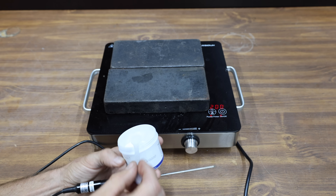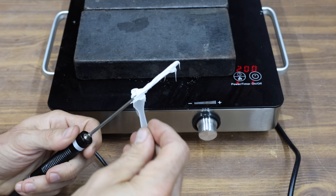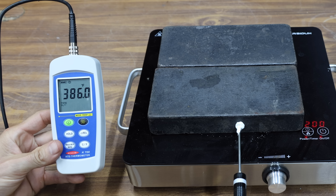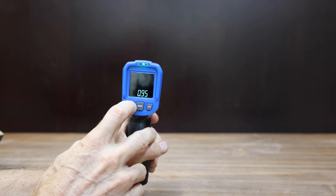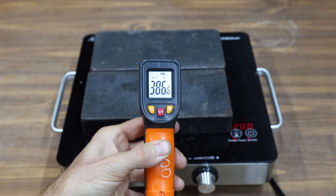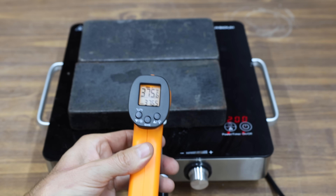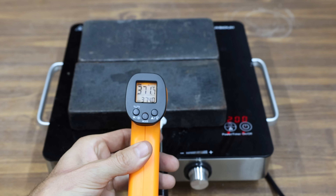Let's test hot temperature accuracy. The steel plates have been on the hot plate for around 4 hours, stabilized at 386 degrees Fahrenheit, with thermal paste applied to the probe inserted into a drilled hole. The factory emissivity setting of 0.95 proved best for this test. The Suncoda came in at 373.3 degrees — 12.7 degrees below target. The T600 again performed very well, off by only 1.5 degrees. The ThermoPro did even worse than the Suncoda at 371.7 degrees — 14.3 degrees off target.